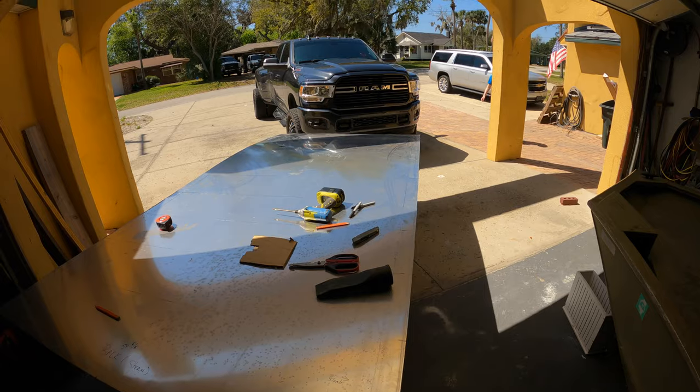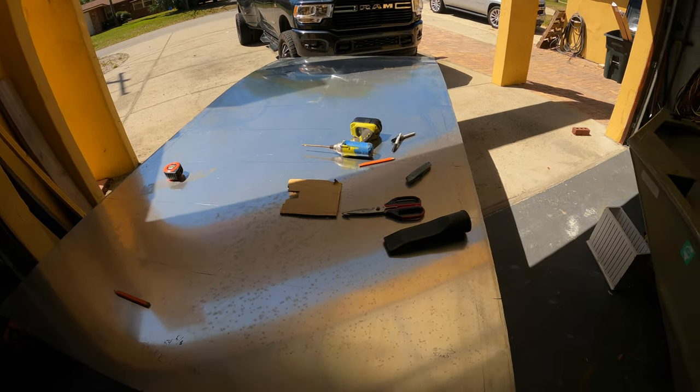The tools we're going to need today: a skill saw with a not-so-good blade - if you got a good blade on it, it's not going to be good for long. A jigsaw with some metal blades, a drill, drill bits, tape measure, all that good stuff. Last thing you're going to need is a welder - it's got to be a big welder, 220-volt. I have a MIG welder, it's a Hobart 220, with a spool gun - aluminum spool gun. It runs high heat and is able to weld aluminum pretty decent. I also use straight argon instead of the CO2-argon mix, just straight argon, which helps me flow the aluminum a little bit better.